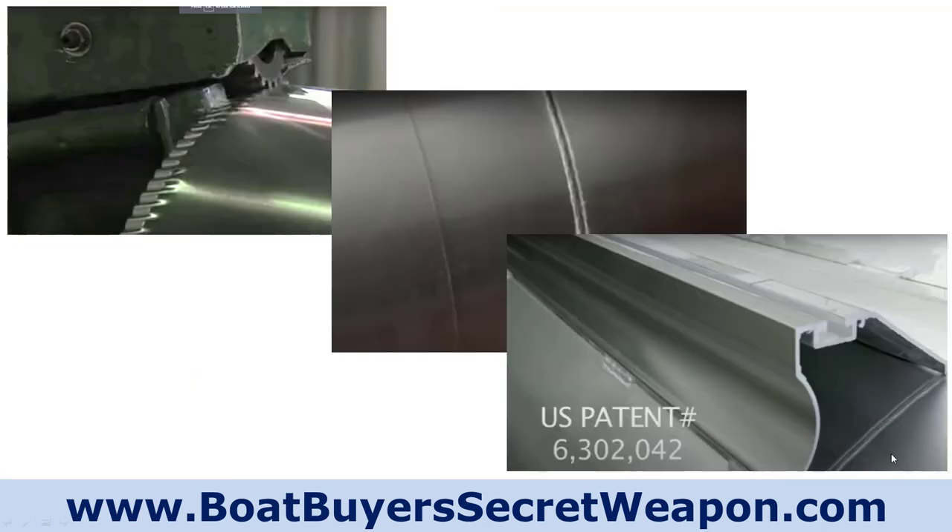There are other things that Harris does really well that you can't really find on the website. Because I'm pretty familiar with Harris, I know that the way they build their boats from the decking down is as good, if not better, than most on the market. The one I would put above them is Barletta on just the solidness of their undercarriage. The top left picture shows them putting that pie-piece shaping on the tubes — they crimp the edges of the pontoon, put them in sections, then baffle them so that if you get a hole in one of the tubes, only that section fills up with water and you can easily limp home.